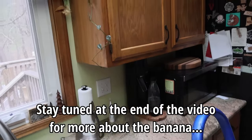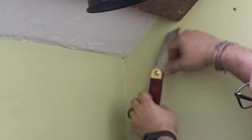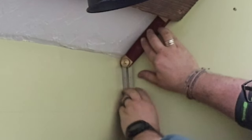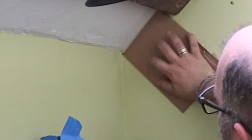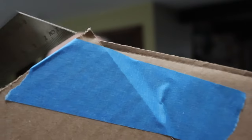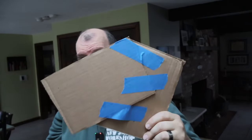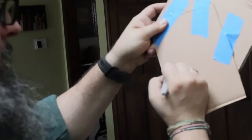Let's take this odd corner in the ceiling. Now let's say I needed a piece of wood here to fit this corner. I know the roof is about 45 degrees to the back wall of the house, but there are studs, drywall, et cetera, between the outside and the inside corner here. That was a tough angle to get to. I used my angle finder — I had to flip it upside down to actually even make it fit there to get that angle. The easier way to do this is with two pieces of cardboard and some tape. I was still able to get that same angle, but what I wasn't able to get with this was that little nibbin in the corner right there. The angle finder could not get that and doesn't fit it perfectly, whereas the cardboard does fit it perfectly. So now I can take this and cut out whatever pieces I need and fit this so it goes up there. So remember to label.